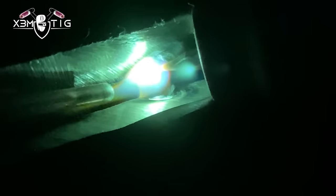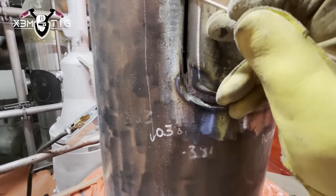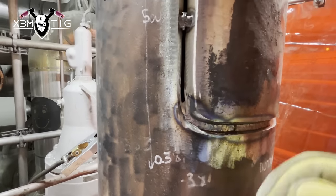The only thing is this is a patch, so it's a little bit tricky — especially going around the corners, the top and the bottom. You don't want to stop on the corner because you can't fit any grinder inside. I would like to just stop before those round corners and try to weld through them, then stop later further up on the vertical part. As long as I can fit that grinder, I'll grind the stop-starts. They're still debating about X-ray or UT — it's a little bit tricky with X-ray, so they'll probably do UT.